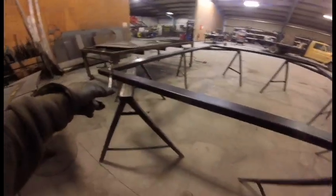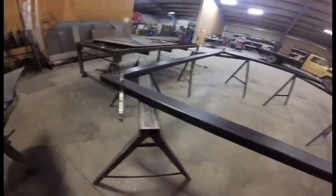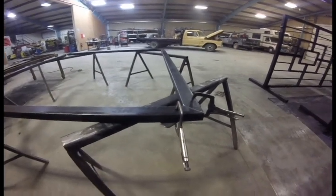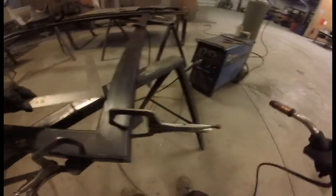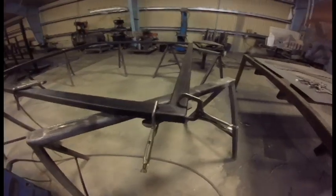I have these two corners square, relatively square, that is. Those two corners are not yet, but if I clamp those, it could get these two out. So what I'm gonna do is I'm just gonna tack the outside corners of these two. That way, it can still flex and pivot this direction, but it's not going to get so far out of square that I have to reclamp it. If anyone's wondering, this is how you make frames for planters too.